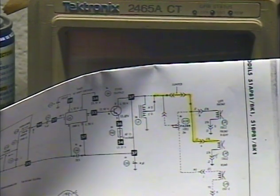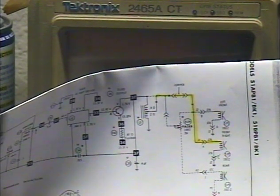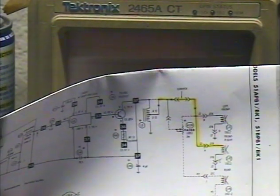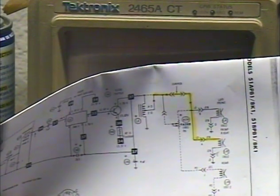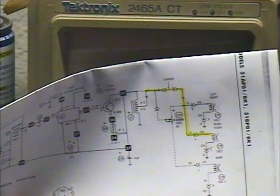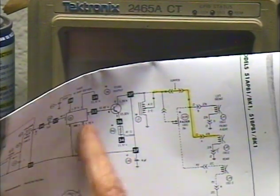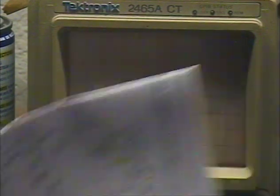So you can fade between left front and the rear, but the right front speaker will remain at the same level regardless of the fader setting, and it's all just coming off of one channel, so you can't get stereo sound out of this. That's just what the original connectors and car wiring force us to settle for.